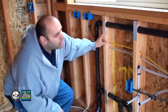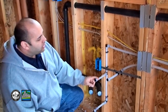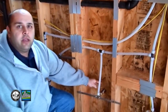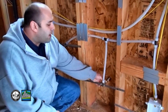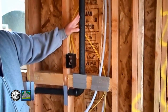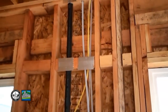That's what the nail plate is for. We come across here and we've got our hot side and our cold side. Hot's always on the left. We've got our supply for our sink, our supply for our dishwasher, and our cold water supply for our sink. We come back across — we've got a hose bib tied into the system. This strap right here secures that for maintenance and repair. We've got our ice maker at this end. Our vent keeps going and should extend up and through the roof. The water supplies will just go up to the tie-ins.